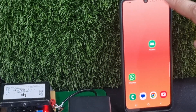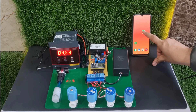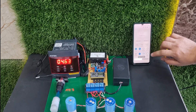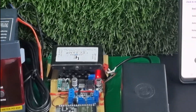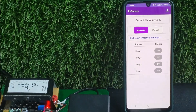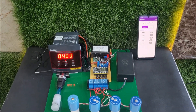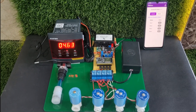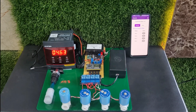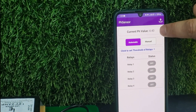The device is connected and we are ready to proceed. We have this app, which I'm switching on. You can see this is the app we have designed — it shows the current pH value we are getting from the microcontroller. Whatever current value we receive at the sensor, we calibrate it within the ESP programming and send it to the server through IoT. You can see the current pH value with very minor fluctuation between the pH meter's value and the app's displayed value.